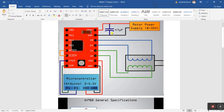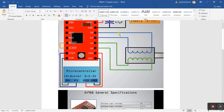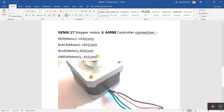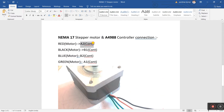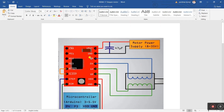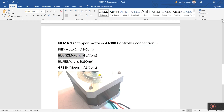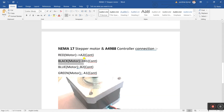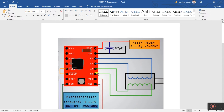The motor has four terminal wires. Please follow this color coding for motor wiring. The red wire of the motor connects to A2 of the controller — you can see the A2 or 2A specification on the controller. The second is the black motor wire, which you need to connect to B1 of your controller — B1 means 1B.